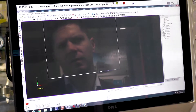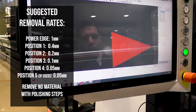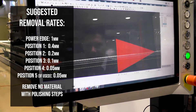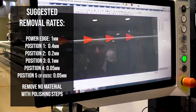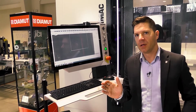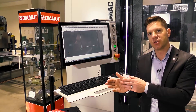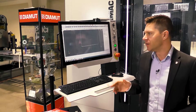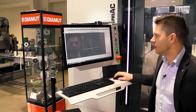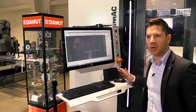Now I'm going to go ahead and apply those sequences — insert machine sequence. Each sequence we have our power edge, position one, position two, three, four, and five getting to the final dimension. What this is going to allow us to see is a transition line for every tool as it goes down, so we can make sure it's touching both top and bottom for the T profile as it moves from position one all the way down to position seven. It's also going to show us our step and show that we're removing all the lines of the tool ahead. This will give us a full map for how the tools are working and how we can maintain them for the future.